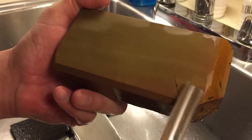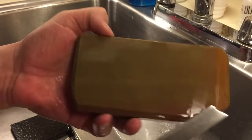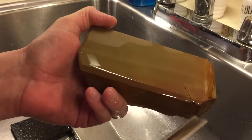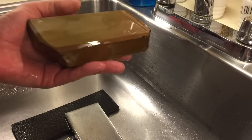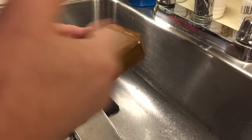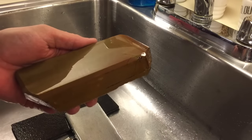There's no tick. Now, if there was a tick — like you take a pin, run it over it, and you feel like a little blip — then you have something to deal with. Maybe you've got to put some CA glue in there, or put some lacquer down really thin, let it get in and seal up, and then lap it down. That usually works too.